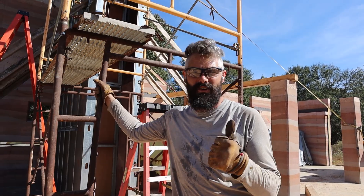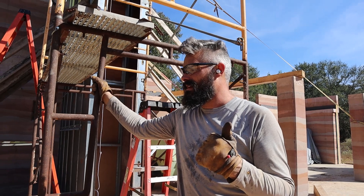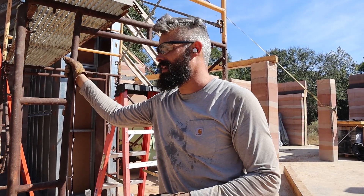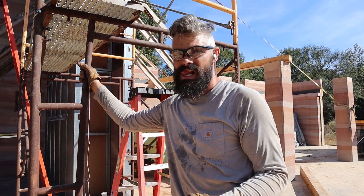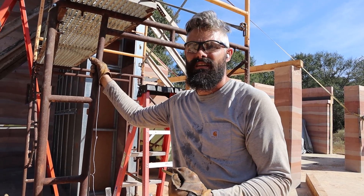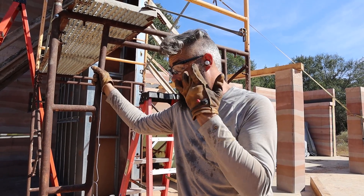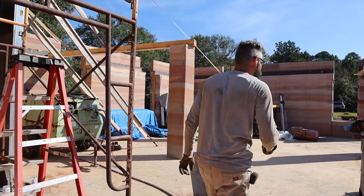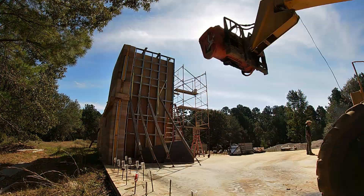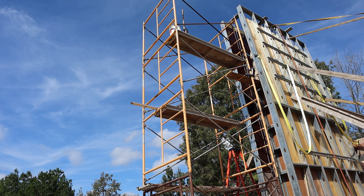I think we're ready to ram. Holes have been drilled for rebar. It's been vacuumed. The rammer's connected. I pulled the hose out of the pulley and ran it just over the top of the form. The vertical rebar is still where it needs to be. You already did the lights on those. Oh, tape — you need to tape the one in there. I think we're good. So we got the first lift about to go in, it's just going to be more of the same. We'll show you when we do the next form piece and put in that really unique piece of foam that you saw me cutting earlier.